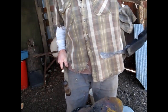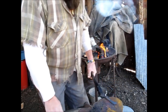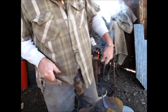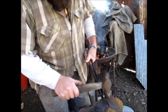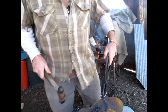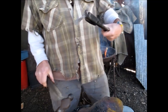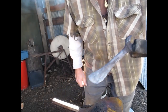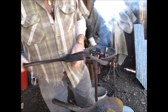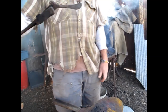Let's see what this is gonna make — it's just a little tiny patch knife or something. It'd be a good little knife; if you had a little sheath or something it'd be kind of a cool little one. Get your top where it starts curling, just kind of beat it back down a little bit. I'm gonna thin that so I can start putting an edge on it. Now I just gotta go work the edge a little bit, then I'll bring it back out and pound some more.